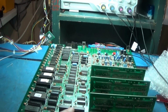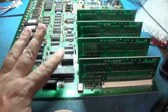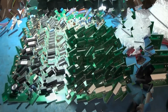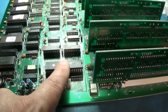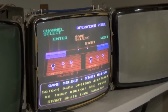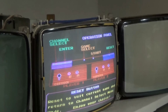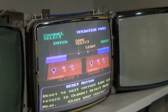Now check this out. I'm going to turn the camera off and I'm going to remove this jump chip, put in the other Z80, and if I remember correctly, all of those names will be goofed up. I'll be right back. Alright, I removed the Z80 and put the other one in and removed the jump chip, and it's running. And the games came up with the proper names. So I don't remember what that was all about. But it's actually running now. But that is just absolutely weird.